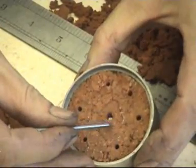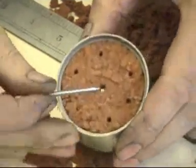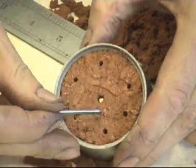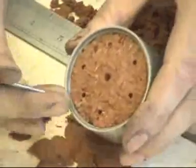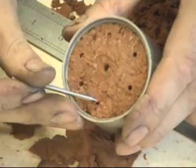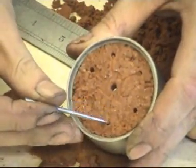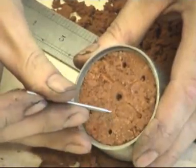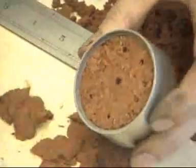Now we're going to connect those holes with a very shallow groove out from the back. And this is where the air is going to escape. Once the gold goes in, there's air inside, and that air has to escape somewhere. So I'm just joining those up. It doesn't have to be very accurate as long as there is space for the air to travel, like that.